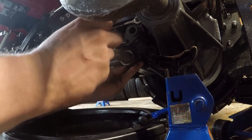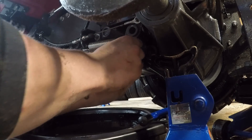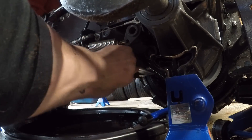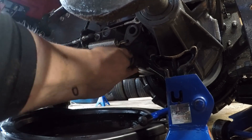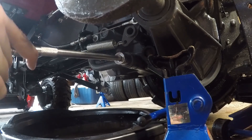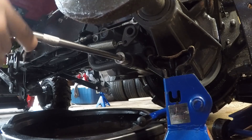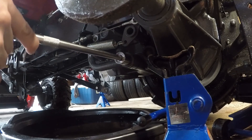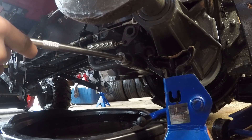After you clean the filter, slide it back into place. Make sure the o-ring on the other side of the fitting is seated properly to ensure no leaks. I recommend being easy when tightening this bolt, as it did not feel very sturdy to me. I did not torque it down to any specific value — I went until it felt tight and checked for leaks afterwards. I did not have any leaks so I found it to be satisfactory. If you do not feel comfortable doing that, then I would recommend torquing it to the Massey Ferguson specifications.